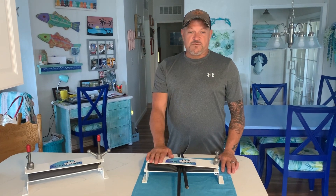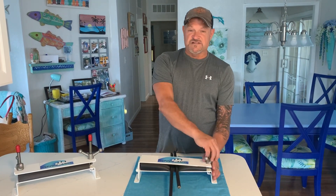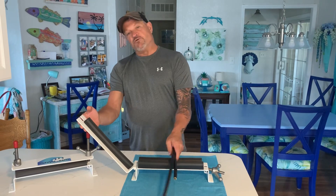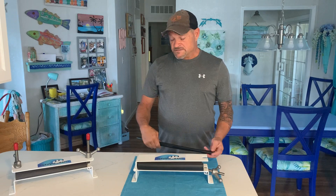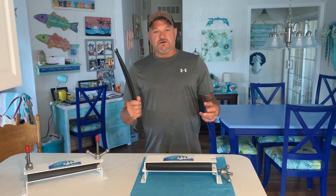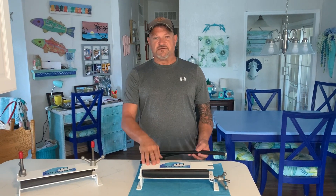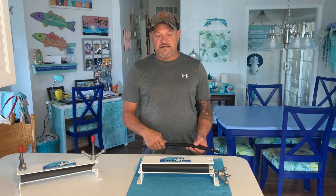When you're done with your work, you basically spin and back this off, or you can put a little pressure here and drop it. This allows it to open so you can pull your cables out and you're done. Hang them back on the line or put them in the manhole. The other great thing about this clamp is it is designed to hold the cables instead of the enclosure, so this will work in any situation — whether you pull up on an outage, if you're on call, or whatever the situation may be.